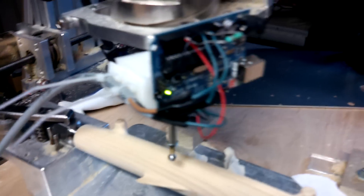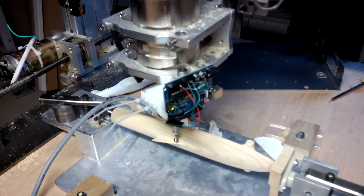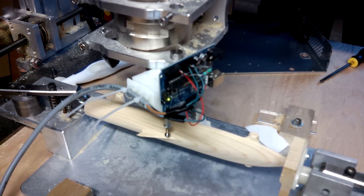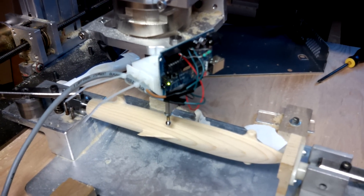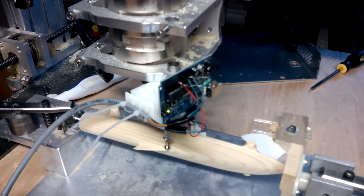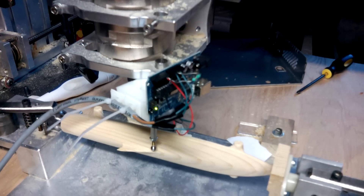I've got an Arduino set up. A little Arduino is running a program measuring the analog voltage across that piezoelectric transducer, and it is measuring voltage generated through this resistor due to the current in the sensor whenever there's strain on that piezoelectric sensor.